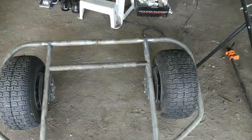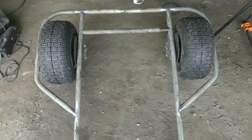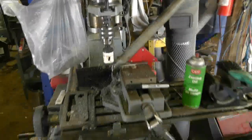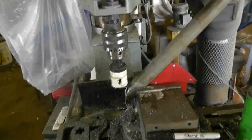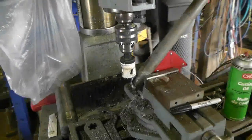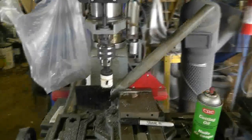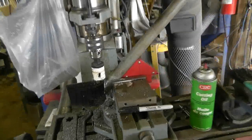Regardless, let's clean this up and sort out how we're going to weld that. Actually, probably before I weld that, I might as well make up my cross pieces. I'm not going to put another cross member at the front — I think that's overkill. But I'm going to do the cross thing, probably for no other good reason than it'll look nice. So here's how I set up to cut at 45 degrees — not exactly the most secure solution, but I didn't have any problems. The most observant people will notice two things: I'm no longer using a 1-3/8 hole saw, and the 1-1/2 inch hole saw I am using is missing a few teeth. You really have to feed real slowly at first, otherwise you rip the teeth off — that's what happened to the 1-3/8 and that's what happened to this one. That was a bit of an expensive lesson — twice.